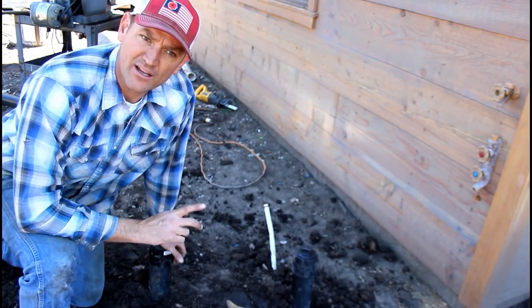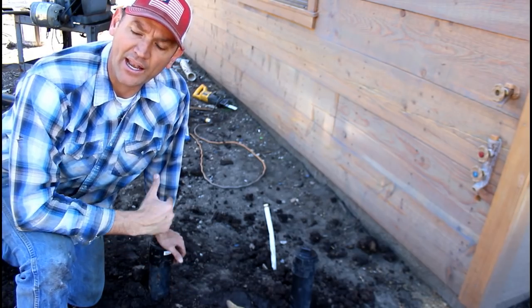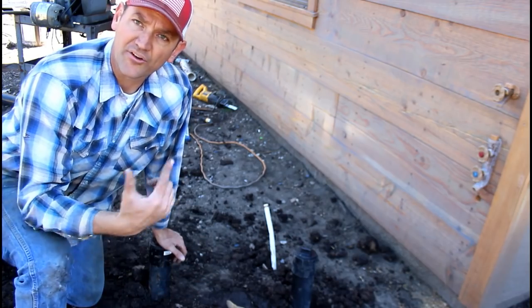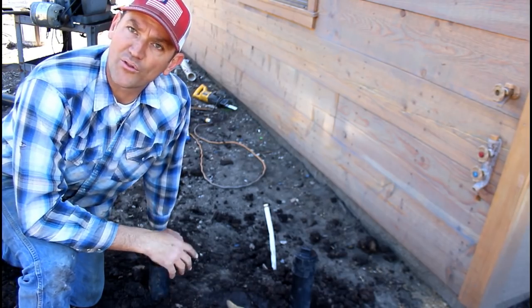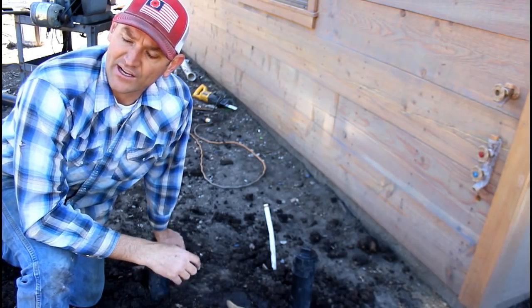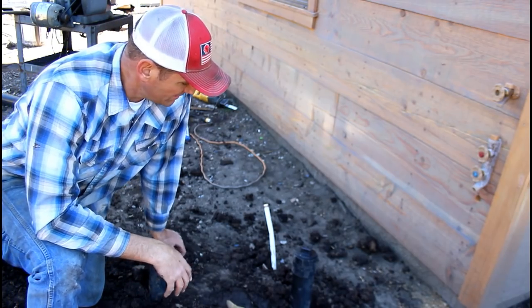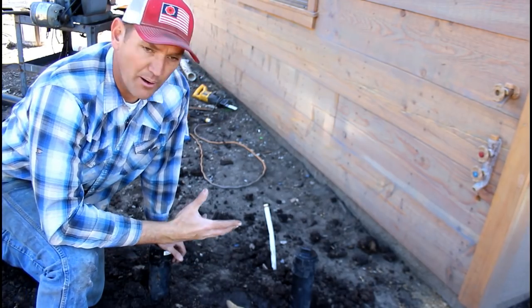I don't know how many times I went out to a job that had a mainline backup, and if they'd had a cleanout accessible, it would have been under a $100 job. But because they didn't have cleanouts, I either had to get on the roof and snake it, which turns into a $200 job, or even pull the toilet if I wasn't comfortable getting on the roof, and snake it from there, which is at least a $200 job because it takes me 2 to 3 times longer to take care of this. So bullhorn cleanouts are required by code for a reason.